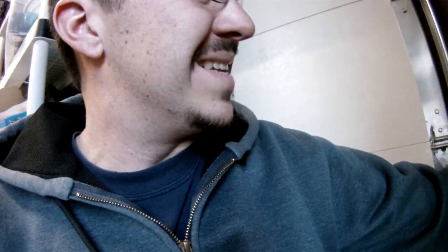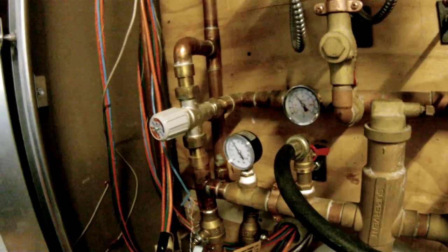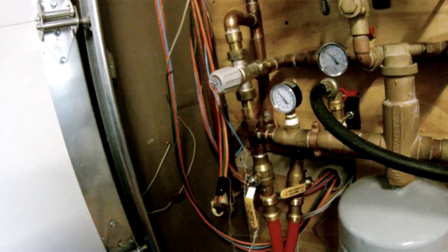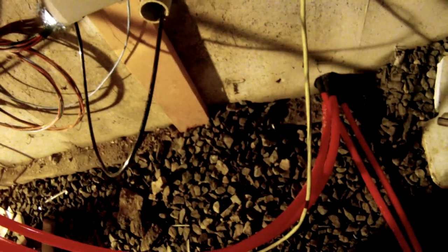I'm going to get out of the garage and leave this open. I don't know how much this system can take — I don't like that much pressure in the system. This thing's made for 25 psi. I wish I could turn my pressure down but I can't regulate it. Now it's holding 38 psi and I see two more drips. Might find more down at the garage — let's see what we find down there. We've got like 45 psi on that thing. Supply — that's water from the roof. I need to tighten these nuts too.